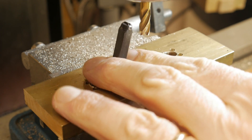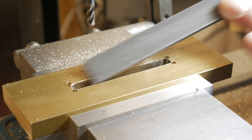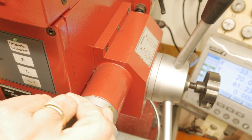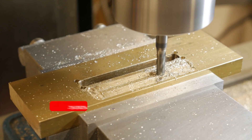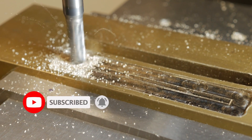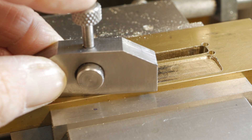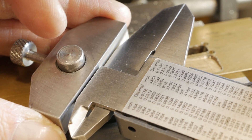I decided to slide the cursor with two guides of different heights. The highest guide is used for the locking screw so as not to damage the surface. The upper sliding part does not touch the piece to be machined, and the brass part is held in the guide by four M6 threaded pins, which I decided to block with a special Loctite for bearings.